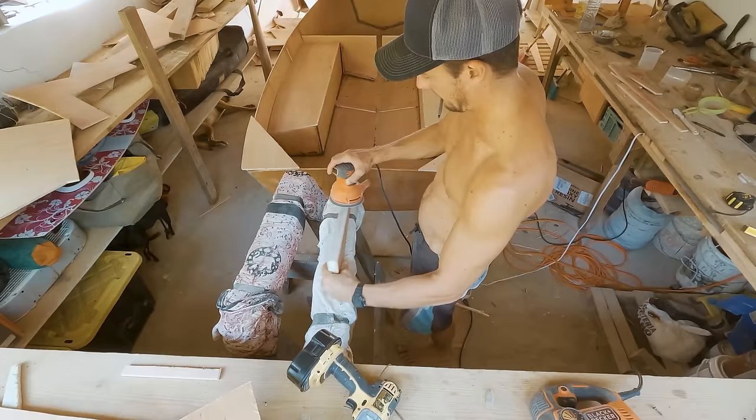Finally, I could start painting some parts. It's important to lightly sand all the surfaces first to make sure the paint mechanically bonds to the surface properly. I decided to test the paint on the rudder and dagger board first — I used regular exterior enamel paint and it bonded really well with the epoxy. Next, I cut out my inspection holes to get access inside my watertight compartments and made sure the plastic hatches fit correctly. I'll glue them on properly once the boat is painted. I bought the plastic hatches on Amazon.